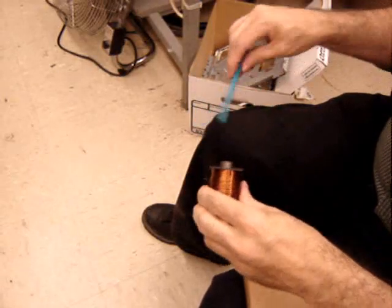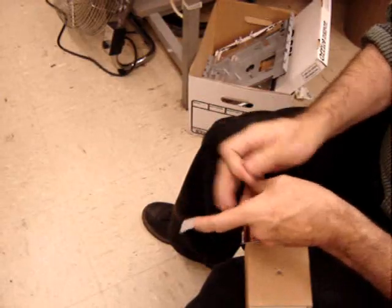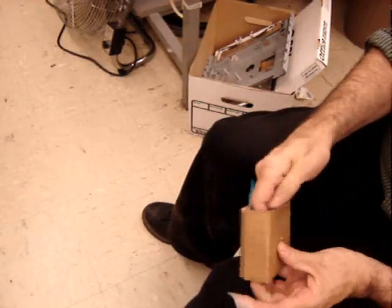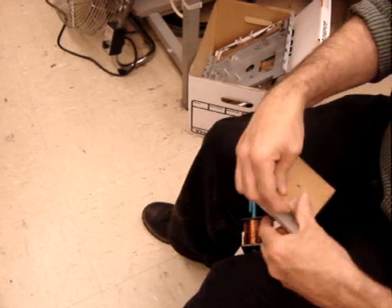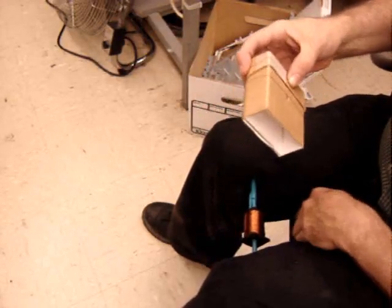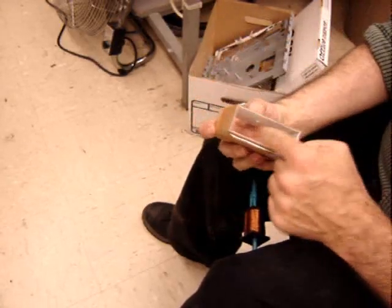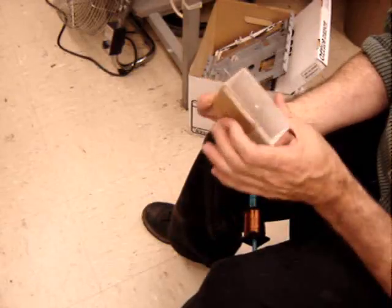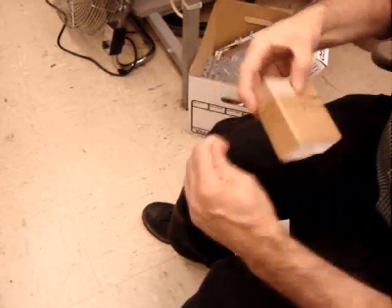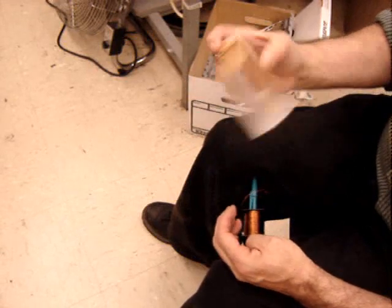To wind two or three hundred turns, just stick your spool on a pen. Pull off some excess and stick it inside so we have plenty of lead wire. Tape it off and off we go. Try to make it in two lumps so there's plenty of space for the nail, and don't wind it across the hole — it's got to go around the cardboard. Don't wind it too tight because after a few hundred turns the pressure can build up and crush the cardboard, so wind lightly. Three hundred turns will let you turn the magnet very slowly yet still light the bulb; two hundred turns if you're lazy.